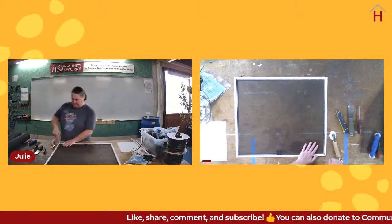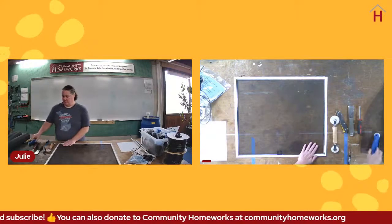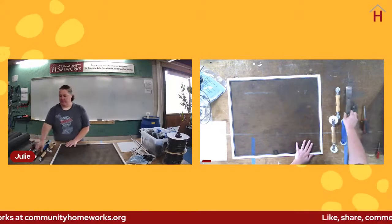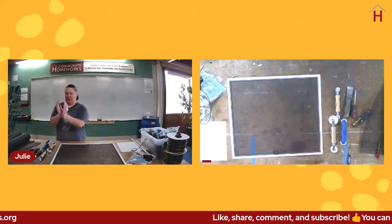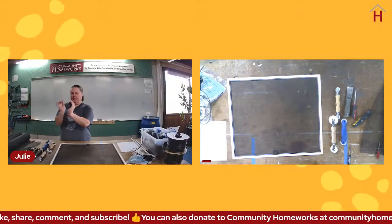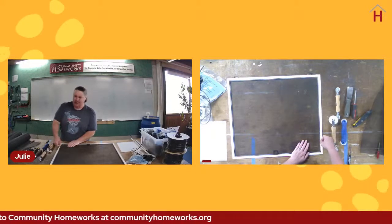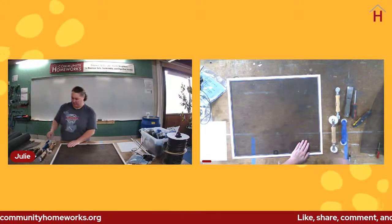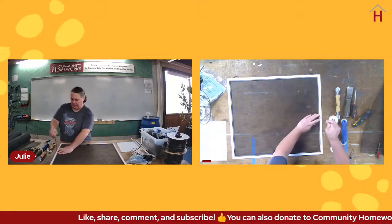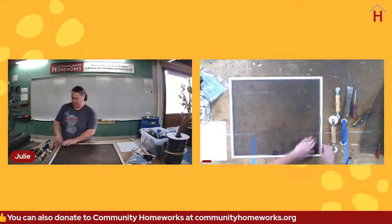And this is sort of the simplest fix. It does require usually one of these spline tools that we talked about, or a lot of patience with something like a putty knife or one of these, because the spline channel is U-shaped, but it is narrower at the top than on the sides. So if you just try to push it in, say with your finger or something like that, you're unlikely to get it completely seated, and then it's just going to pop back out a couple days later. So if you do have a screen that has pulled out of the spline, it's the easiest thing to fix. Just make sure that the screen itself is intact.